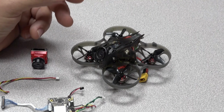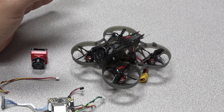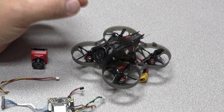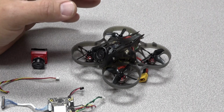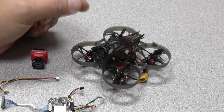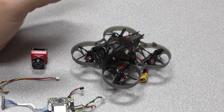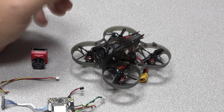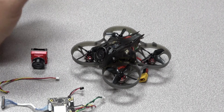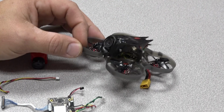Again, if you're flying in D16, stop now, go into the configuration tab of Betaflight and change the SPI settings from FrSky X protocol to the FrSky_D protocol. Then rebind your model to D8 mode. Listen, you've been warned. It's going to fail safe in D16. Happy Model, if you're watching this, please send these factory default to D8.